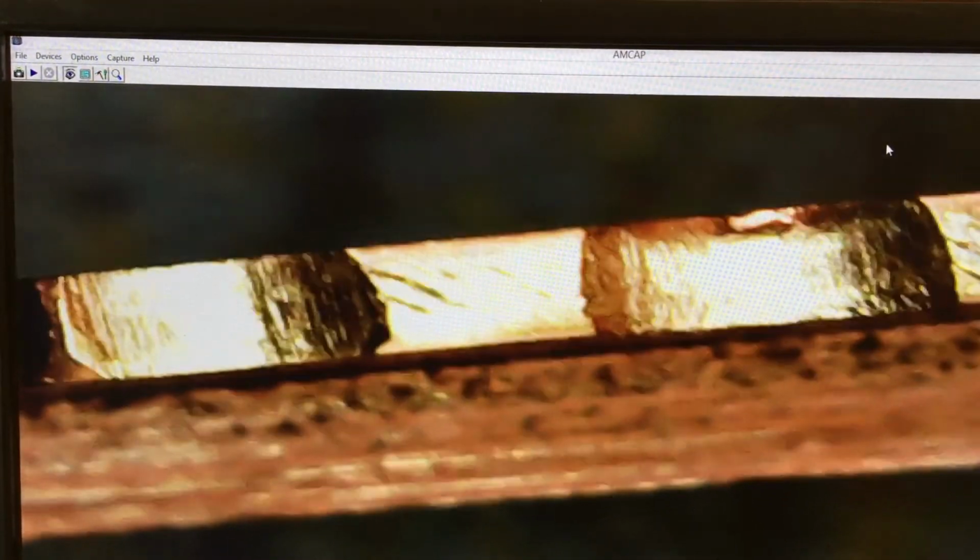Okay, right now all of our cuts are at a 1. Anything that leaves a mark from now on, like that, we're going to take to a 2. I'm going to clean that off, and then we're going to check it and run it again, because that could be just a burr or something that I did. But I doubt it. I think that might be an actual mark right there, that I haven't filed down enough. It was probably that deep. So I'm going to go through this key using this method and see if we get an open.